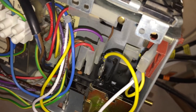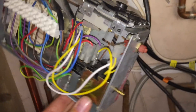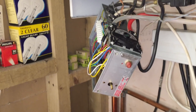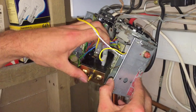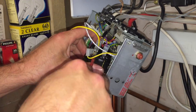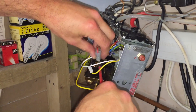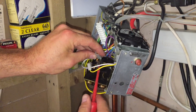Something I always do on these sorts of things: I'm going to have a little peek in here with the phone. I would usually just take a photo of this so that I can't forget which way around the wires went. Really simple way of keeping a record. I'm going to try and remember this by saying it's purple, red, brown — PRB instead of PRV.